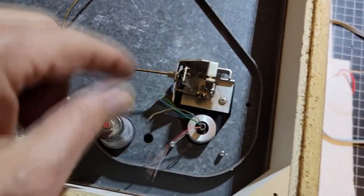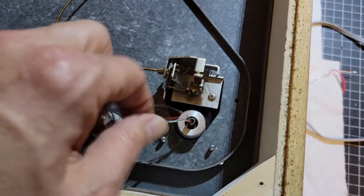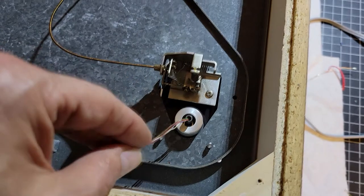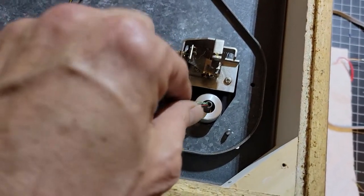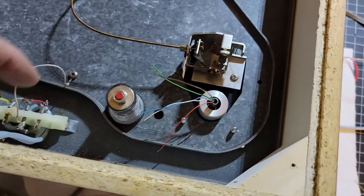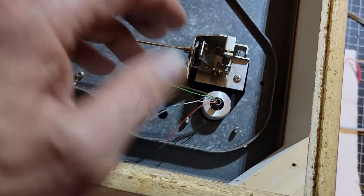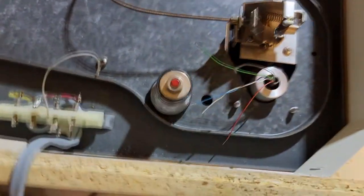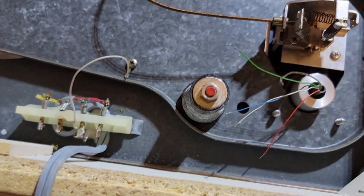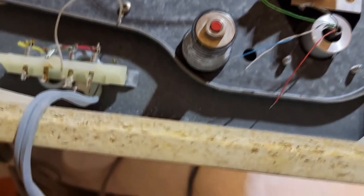And that's probably what they found was these wires actually act as a sort of a spring to anti-skating. So the longer you have a lead of wire, there's more weight to it. It applies some forces to the tone arm, and it can skew your weighting of the arm and the anti-skate balance and everything. But not such a big deal.